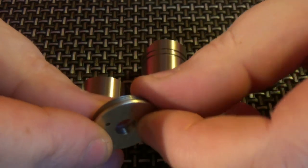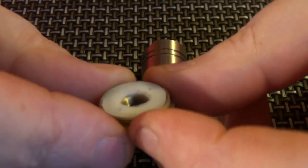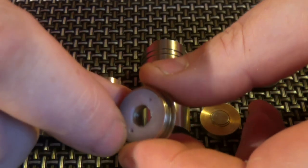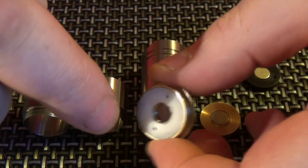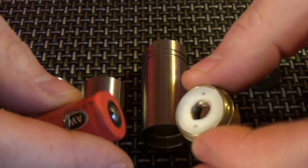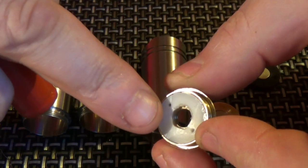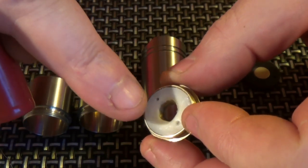Starting with the top cap — this will vent through the button. I can blow through the tube and air will travel down through the button. You can see there's a white Delrin piece — I made that myself. This means there's going to be no shorts from the nipple onto the top cap. I would imagine the final product that Shmo Vapes are going to sell will be something similar to this. Basically, it just means that when your battery touches the top, it's not making contact with the brass top cap at all. My version — I had to make my own Delrin insulator — but the version that is going to be sold by Shmo Vapes will be insulated.